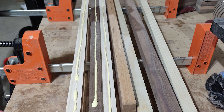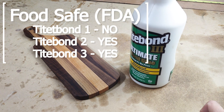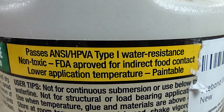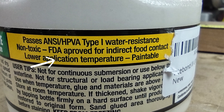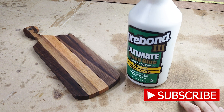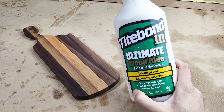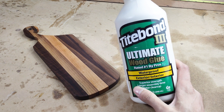The story is a little complicated — not really. The answer is mostly. Titebond 2 and Titebond 3 are both rated food safe for indirect contact, according to the FDA. You can see that on the label here, so definitely look for that. Never make the assumption that your wood glue is food safe for indirect contact unless you see this on the actual bottle. Titebond 1, the one that comes in the red bottle, does not share the same status, so be mindful of that. Other wood glues don't tend to make this claim — Titebond 2 and Titebond 3 are the only ones that are super common that I know of that make this claim.